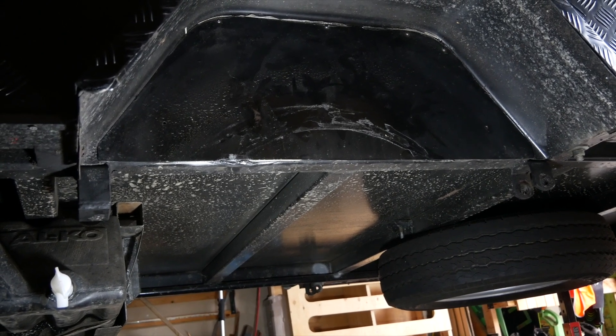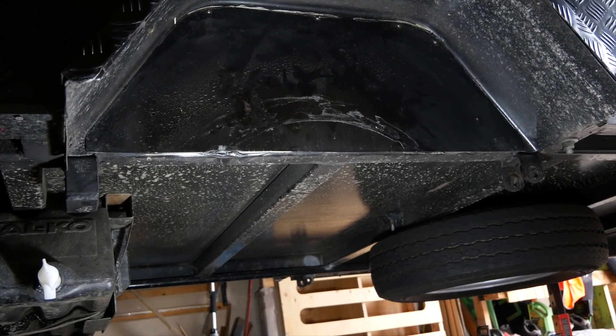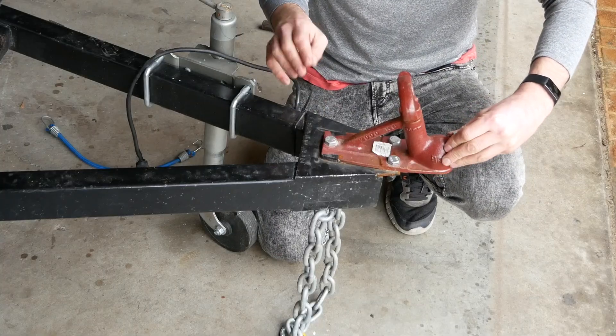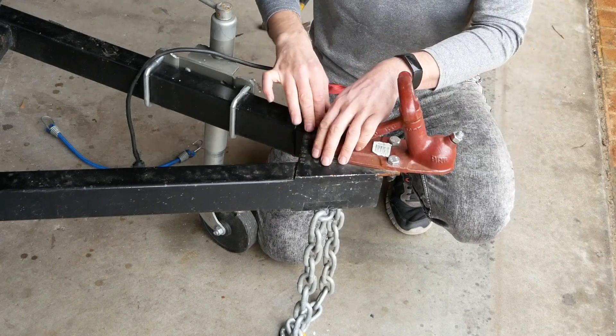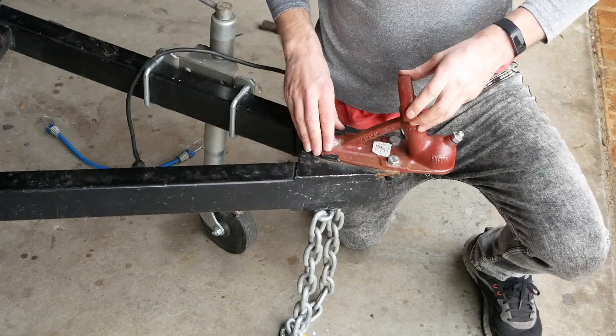As you can see I've pulled apart the existing axle, wheels, and basically the entire system so I can assemble it all again with a new axle, hubs, and brakes in place. I'll need to remove the existing coupling and the plate that it sits on, and install a new plate with a new coupling designed for the brakes.